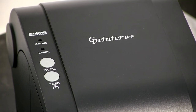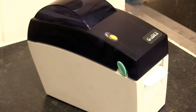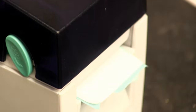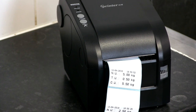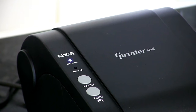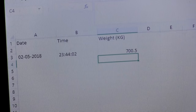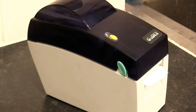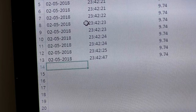There are two printers available. Both allow you to print sticky labels from the scale. Choose the Godex thermal sticky label printer for 56mm wide labels, or for labels up to 76mm wide, choose the GP3120. If you want to print as well as send data to a PC, you'll need to use the Godex printer, as this allows you to connect the printer and the PC cable to one port and send data to both when you press print.